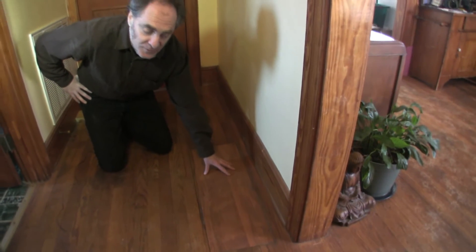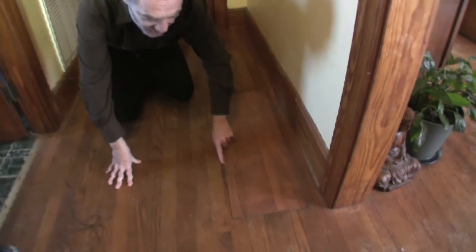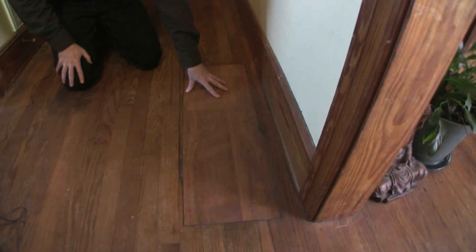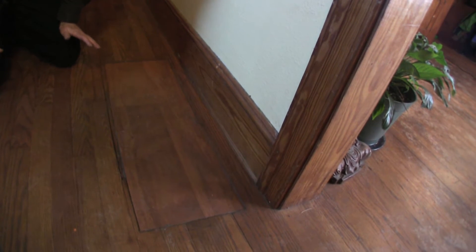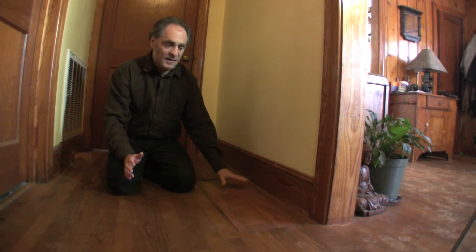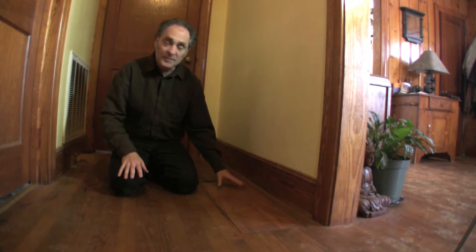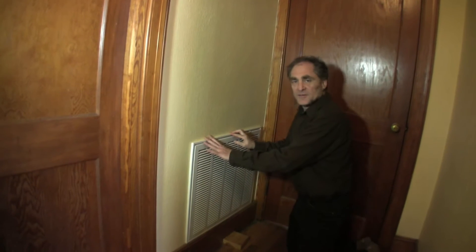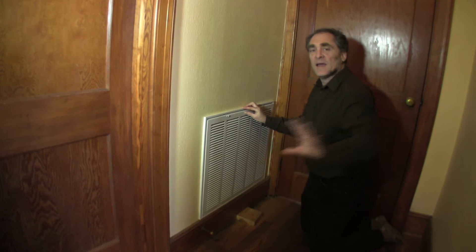You might have a return in the floor. What you're looking at here is where the return used to be — it was covered up and air sealed with caulk. The downside of a return in the floor is two things: one, a return built into the floor joists tends to be very leaky and difficult to seal. Two, because it's in the floor, a lot of dirt falls in, and the filter gets clogged quickly. In this house, the return was sealed up and moved. It's important to air seal all the edges with caulk. The return grill is where air is sucked back through the ducts to be heated and sent to the supplies.